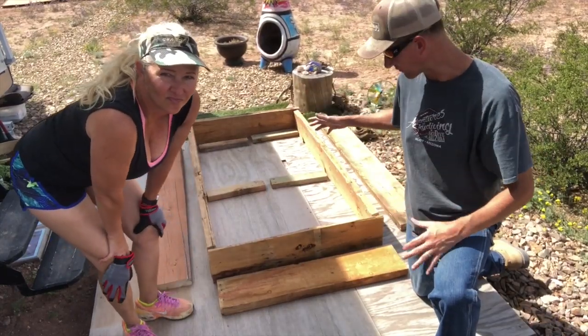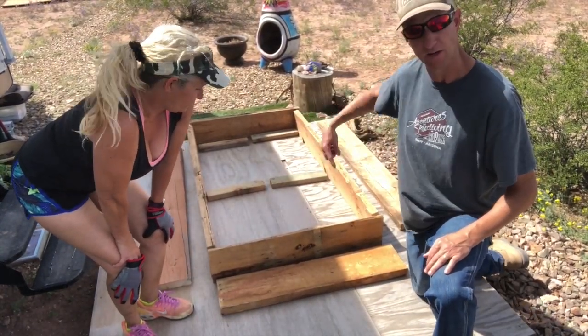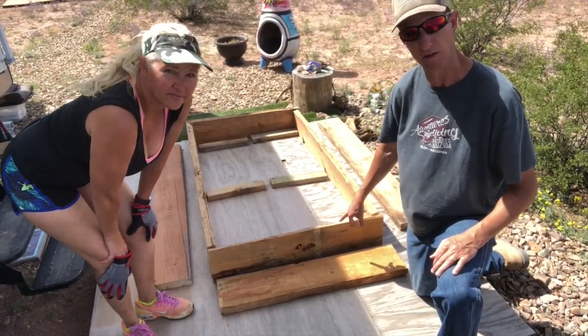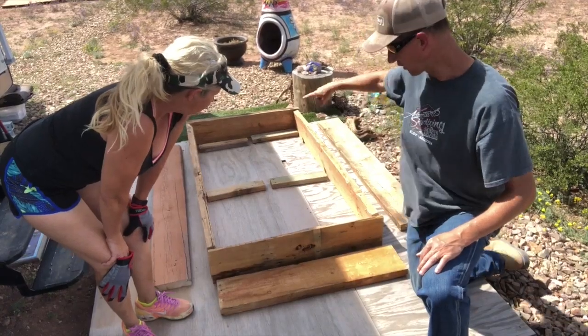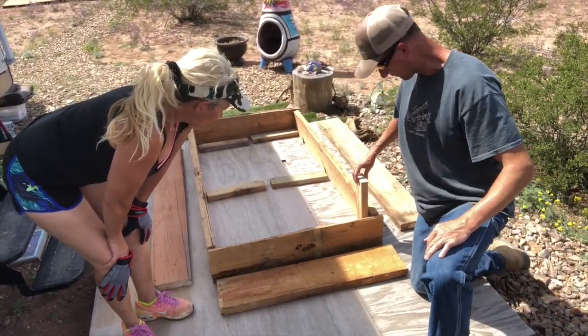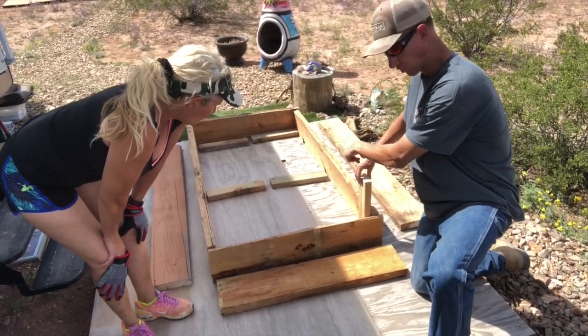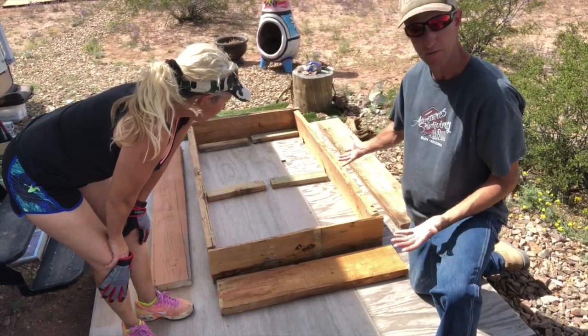We're actually going to put a cover over, so we're going to build 2 courses of just lumber, 5x3. These are 2x8s, I believe. So that'll give us about 15 inches high. We're going to go 5x3 on all sides. We're going to stand up some 2x4s in the middle to kind of tie the 2 courses together. We're going to go 2 courses up, and then after we do that, that's pretty much the box.